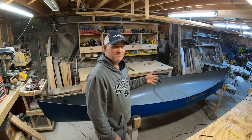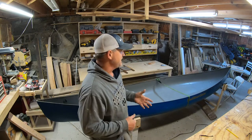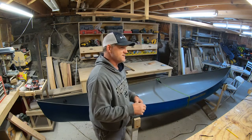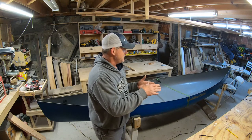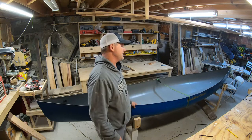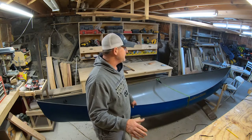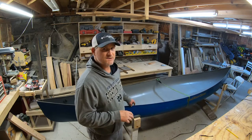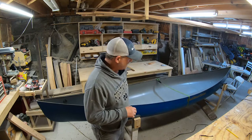It's gonna require some tape on the backside to catch the epoxy resin. And then on the other side too. And I just need to get something that's gonna be able to inject that G-Flex. Maybe from the top side, but I'm going to work it in. Anyway, the cold cracks need to be addressed next because I have my paint on order. I want this epoxy to cure. Then I want to get to ripping down the gunnels. And then I want to be able to prepare the hull.